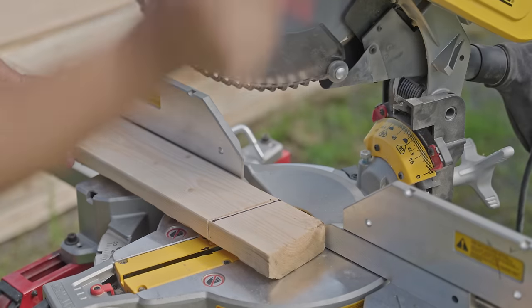So I hold it flush up to the top here. The line is hitting right at the edge of the double plate. It's perfect. All right, we're just gonna come out here, make that flush at the top. I'm not taking into account the fact that our double plate, we have sheathing on the backside, right? So I'm gonna have to make this board an extra half an inch longer on the backside to cover past the sheathing. We were measuring off the top of our double plate, this point right here, but our sheathing is here.